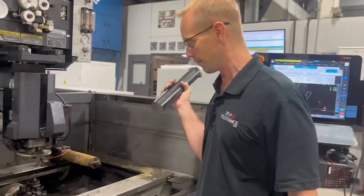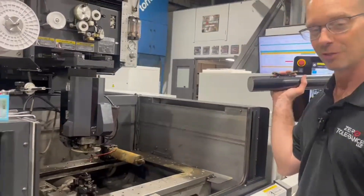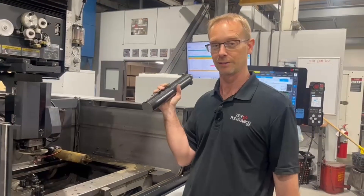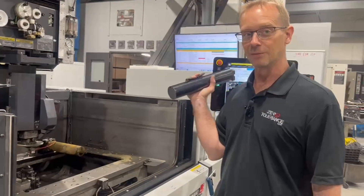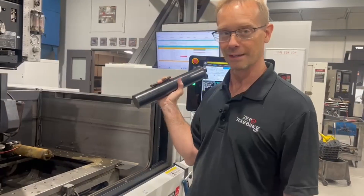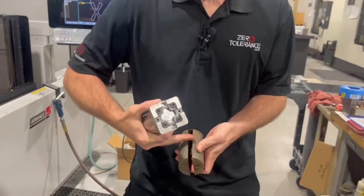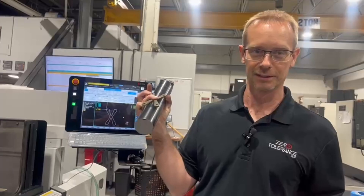My thought was maybe there's a conductivity issue. I've got a wire connecting the table to the part just to make sure that's not an issue. So what I've done is gone from a medium-grade wire to a high-end grade wire, and the difference in spool cost is about a hundred dollars a spool. But if it saves me a couple of hours, or even just one hour, it's going to be worth the time and effort. When I've got a single pass that can take up to nine hours to make this simple path in and out to produce these crosses out of this round stock — not fun. Let's see what happens.